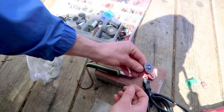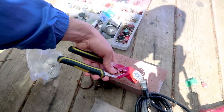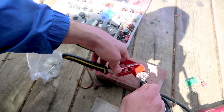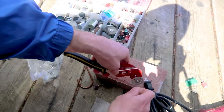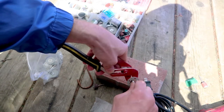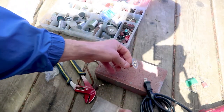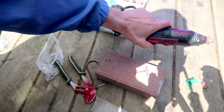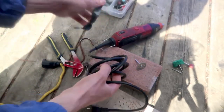Here's another technique you can use to hold the bits. The bits are sometimes a little hard to hold when switching — say a disc, in this case a diamond grinding disc. I'm using the pliers to hold the disc and the screwdriver to tighten it in place. This is the screw on top of the mandrel. You can also use the rotary tool to hold the mandrel in place, then unplug it, lock it, and tighten it — but sometimes it's easier to use the pliers.